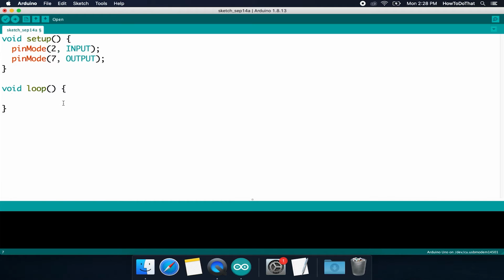Now, for digital logic, things can only be off or 0, also known as low, or they can be on or 1, also known as high. You will find that we will interchangeably use either the integer or low or high. They mean the exact same thing. What we're going to do is first create that place in memory that we were talking about earlier, and that is what is going to be called a variable. A variable is a reserved spot in the Arduino's memory that can store a value that will change over time. Now, we have to be the ones to change it.